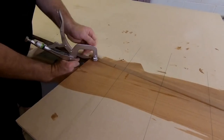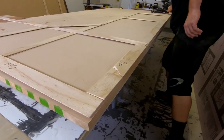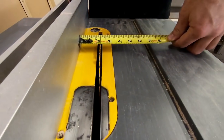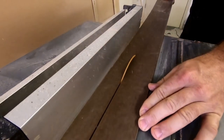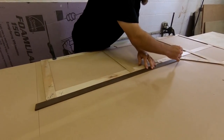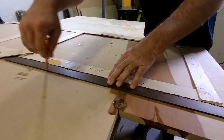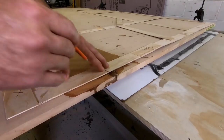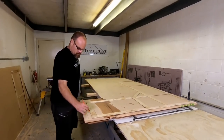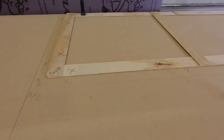After about three hours, unclamp your seam and you're ready for the next step. Put your template material on the long run of MDF, clamp it down, and trace the template all the way around. We're adding a one-and-a-half-inch overhang, so we set the saw to one and a half inches and use a scrap piece of material as an edge guide to butt against the template material and trace the perfect overhang. We know from our notes and great template that this is going to fit perfectly.